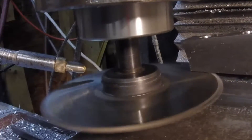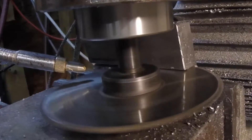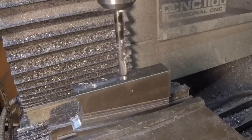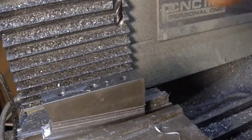This part I had to fuss around with a lot to get it right, but I finally came out with 300 RPM, half an inch per minute, with a full three-eighths inch depth of cut. I was able to do that in two passes, and it worked out really well.